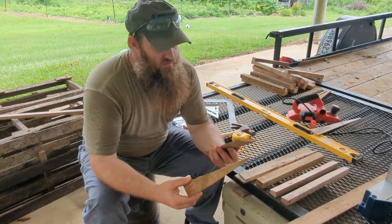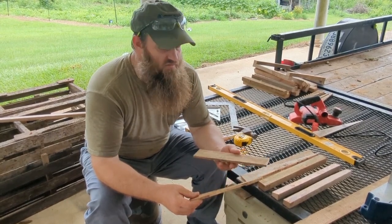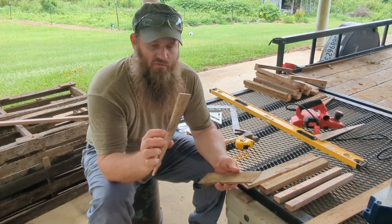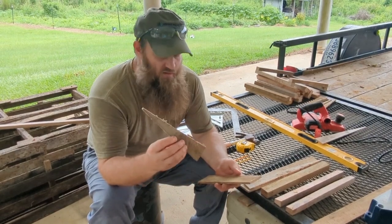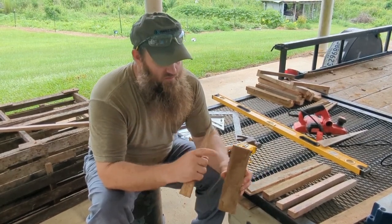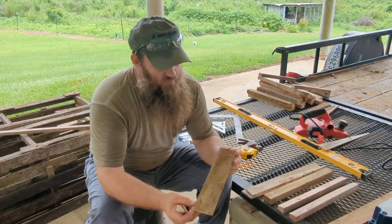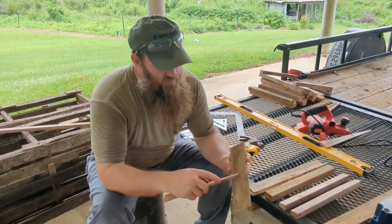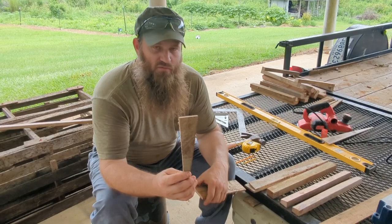This is just a ten-inch piece of the slats. These are two to two-and-a-half inches wide — all of the ones that I've gathered up. This is what's going to be the first throat, the front throat or flue, whichever you want to call it. We're going to need 20 of these for each trap. So the easiest way to cut these is cut some slats two to two-and-a-half inches wide and cut them ten inches long. Go ahead and cut them on the miter saw, then take a straight-edge mark and cut that, and it's going to come out close enough to use for our throats.